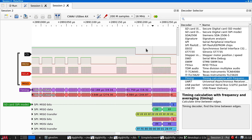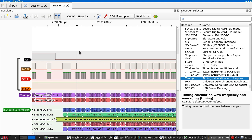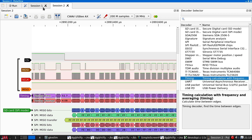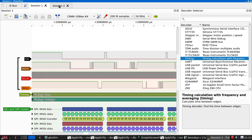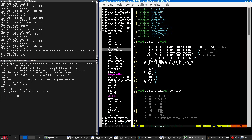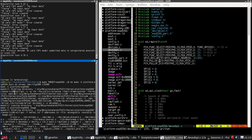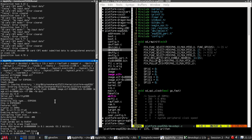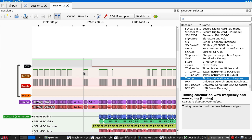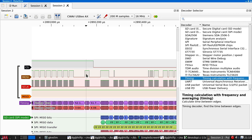So what else could be going on? I did find some references to needing pull-up resistors, which I have enabled, but maybe they need disabling again. The biggest difference I can see is the way that MOSI gets deasserted between bytes.